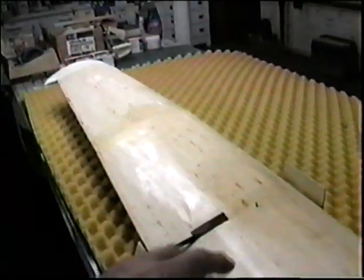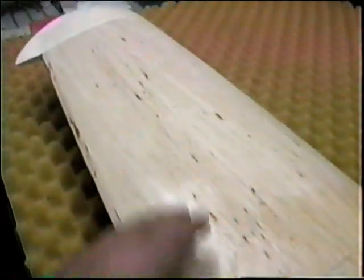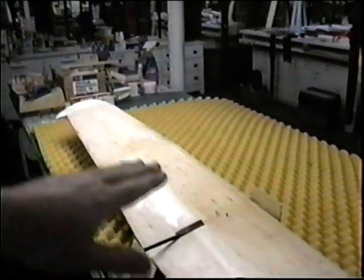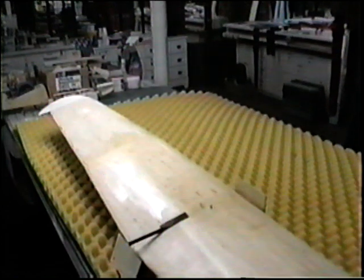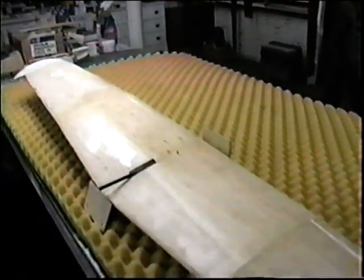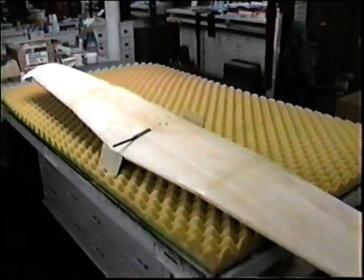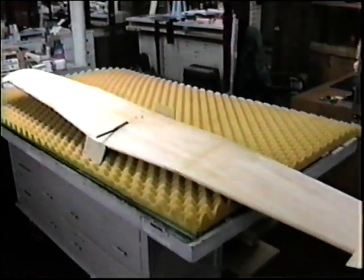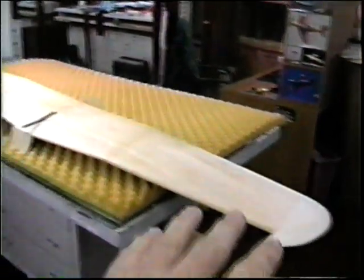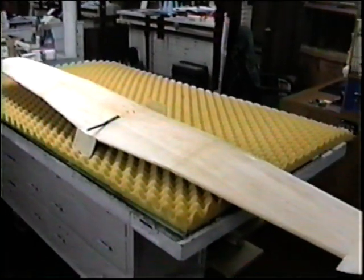Of course, the areas that have the fiberglassing stay shiny while this gets dry a lot quicker. So what I'll want to do, again, is put on the raw wood at least one or two extra coats, where on the fiberglass you really only need maybe two or three. I want plenty on there, because the next step is I'm going to block sand all these sheeted surfaces out.